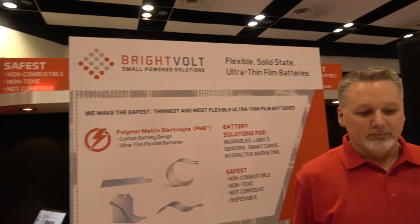When it's rechargeable, the goal will be 300 to 500 cycles, just like conventional rechargeable cells, but you will still have the ability to flex the battery. The flexibility is what most of our customers are looking for, besides the ability to get the same voltage — 3.6, 3.7 volts — and the same types of capacities. Capacities can run all over the place, but we'll probably start with something in the 50 milliamp range up to 600–800 milliamp hours. If someone came to us and said they want a 2 amp hour battery, we could still manufacture that and give them the flexibility they need for things like clothing.